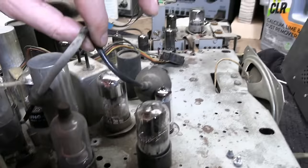There should be two fuses in this — one on the B+, and this will be a fuse just for the flyback. I want to do something about this once we get it working — it got mushed down a little bit and it'd be nice to get it leveled out. Got more remains of a candy wrapper down there — it was a Hershey's Kiss. I found a label on it. We can blow all that dust out. There's our high-voltage doorknob cap, there's our high-voltage current-limiting resistor at 680K, there's our high-voltage lead, and 6BQ6.